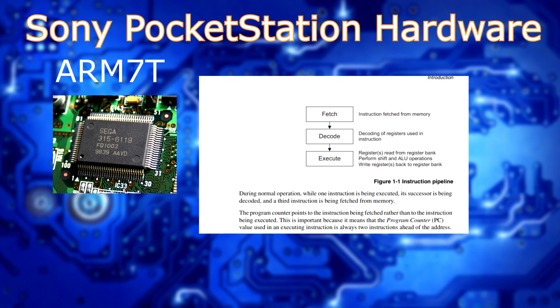With this choice of processor, the Pocket Station could consume as little power as possible while containing quite a bit of RAM and Flash. Flash was pretty expensive at this time, so 128 kilobytes was no slouch. Essentially, this multi-purpose CPU was configured with peripherals and was just a microcontroller — really all it was looking for was six button inputs, one speaker, one monochrome LCD, and that was pretty much it.